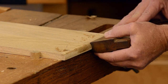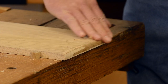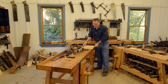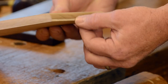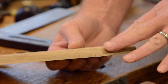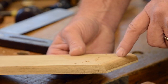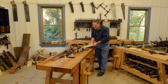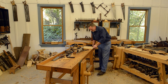So you can see what I've got there. I've got a little flat left here, and what I'll do — even though I've done this with a hollow — it's kind of rough, it's end grain, so I'll hit this with a little sandpaper and as I do I'll take that little flat that's left, but I want to leave this gauge mark because that's going to do something else for us in just a minute. We'll do one more — it doesn't take long and they don't have to be perfect.